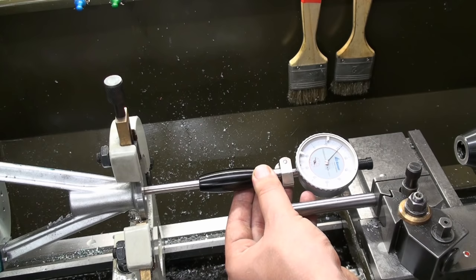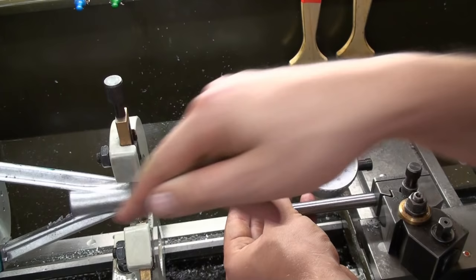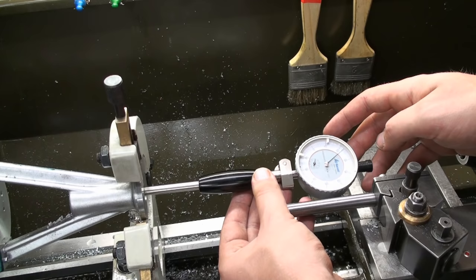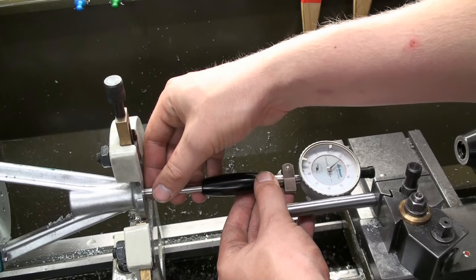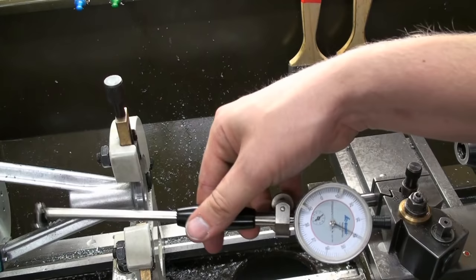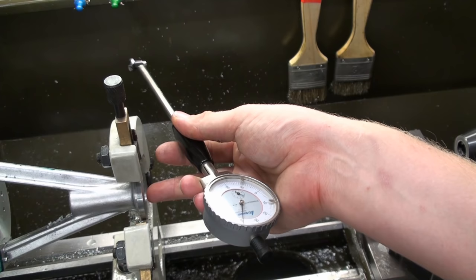Yeah, that's not too bad. 1/100th of a millimeter conical, but that might be due to the tool, the deflection of the long outrigging tool. But as you can see, this is a very fast way to measure. The only problem with it is that you have to calibrate it for each use. But apart from that, very useful. So we need to go another 0.21 millimeters.